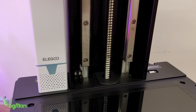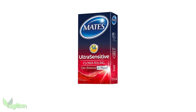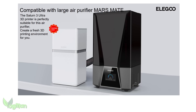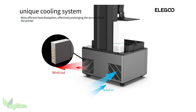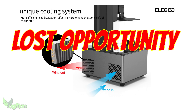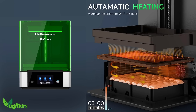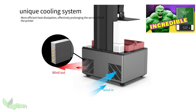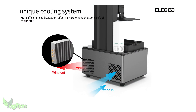Despite being two ports, there's only one air filter included. Elegoo will soon be launching a pretty substantial looking air purifier, the Mars Mate, which is an interesting name choice. The back of the printer has two fans — one in, one out — which is apparently more efficient and prolongs the service life of the printer. Personally, I can't help but think it represents a massive lost opportunity for Elegoo. Why not use the built-up heat to warm the resin tray, like we've seen with the Uniformation GK2? And why not make one of these an easy point for a cartridge filter, again like the GK2? It's a shame, because a move like that would have made this printer stand out.